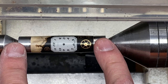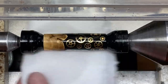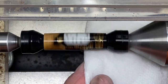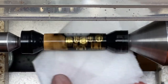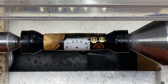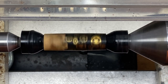I'm going to get this blank on my nonstick bushings and apply some CA to seal this blank. With the blank mounted between the nonstick bushings, I'm going to use denatured alcohol to clean the blank and get any dust out of the wood. I want to make sure there are no oily fingerprints on there — I touched this with my hand as I moved it from the turning bushings to the nonstick bushings and I don't want any oils that could react with the CA and cause the finish to haze. So I'll let it spin for a few minutes and make sure all the denatured alcohol evaporates, then we'll come back and apply our CA finish.